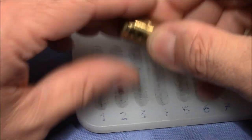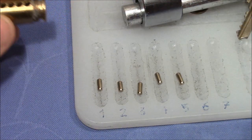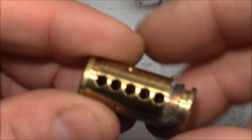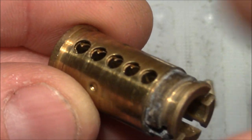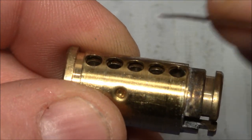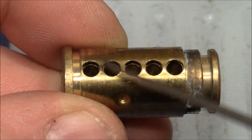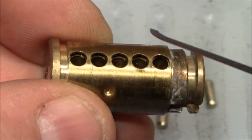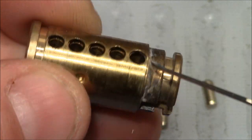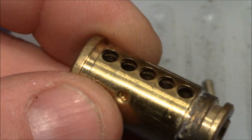Here is the plug with all the key pins in working order. One, two, three, four, five — very nice key pins. Very smooth, very long actually. Is there counter milling? Yes, there is. There is deep counter milling. That's why you can only pick this lock with very light tension. Otherwise the pin gets caught in this counter milling and you won't get any kind of feedback. Very cool plug.